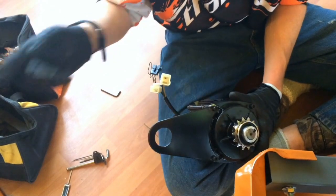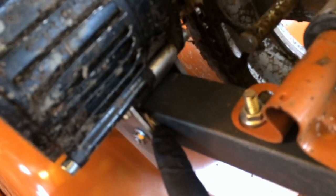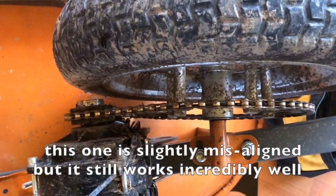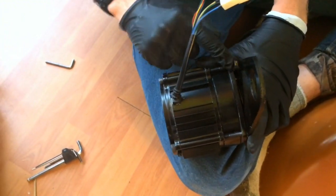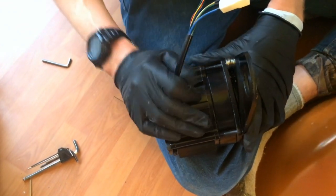What I did on his that's different than mine: on mine I basically used wooden wedges to get the angle right and then used washers — three washers on this side and three on the other side to get the angle so it lines up with the wheel, because the metal handle is not perpendicular to the wheelbarrow. On this one I've eyeballed it at about four washers on the front, which is going to space it out and make the plate mount at a strange angle.